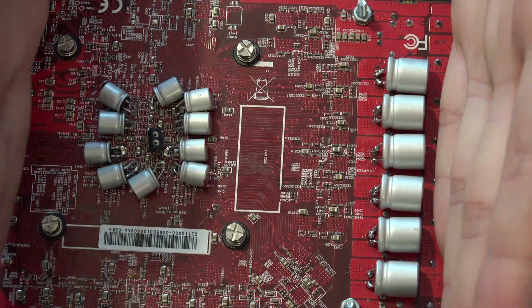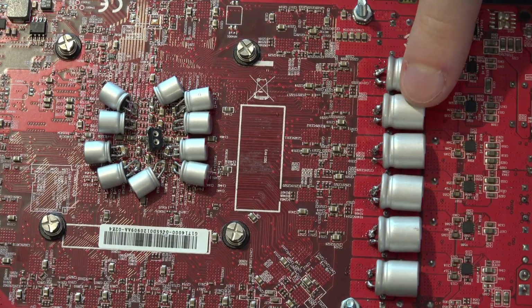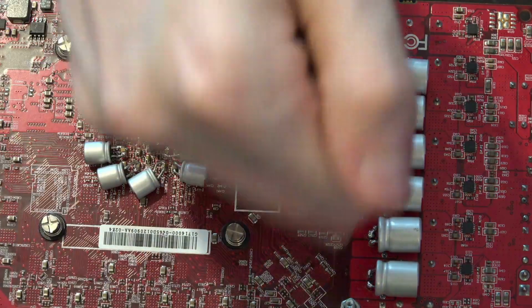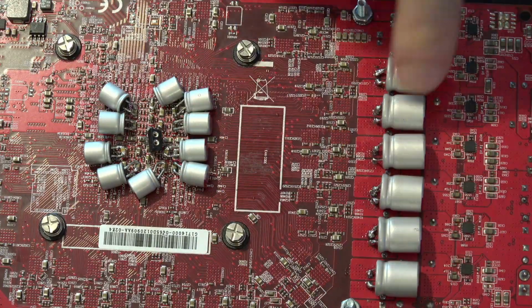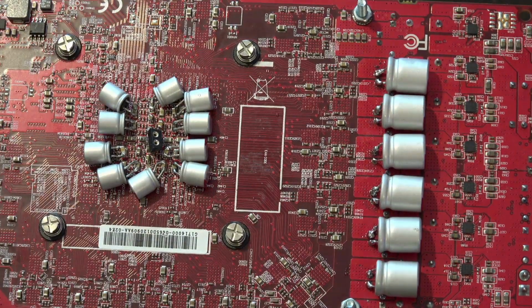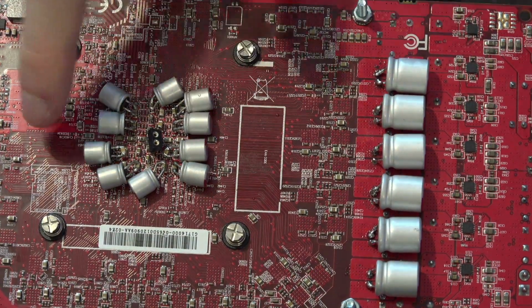we look at all of the capacitors on the VRM, the highest voltage caps charged to the highest voltage will be over here. And caps charged to the lowest voltage will be basically on this side of the GPU core. So if I have a bunch of capacitors sitting at a lower voltage than everywhere else, then when on load release we have a bunch of extra energy getting dumped from the inductors, these will take more energy to charge up before we start getting high voltages, because they'll be below the VRM voltage anyway. So that's the logic of why I wanted to put them there.